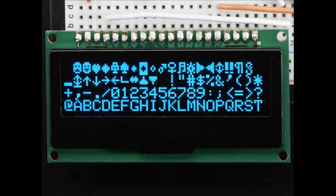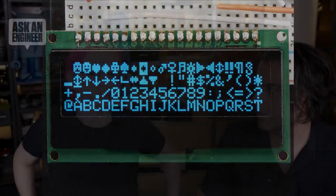It does use only 3-volt logic. You can use I2C, SPI, or 8-bit. We include a level shifter with your order so that you can use it with SPI. I wish they would have included it on the PCB, but they don't — these are pre-made modules. So we decided to just give you a level shifter. That's nice — not like some people who would say you have to go buy one. They're stingy. This is like 30 cents, I just toss it in.